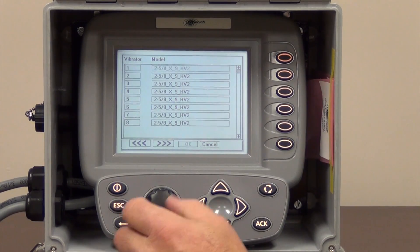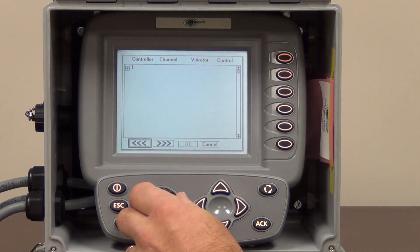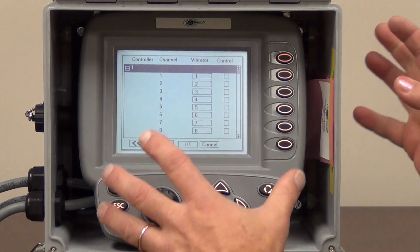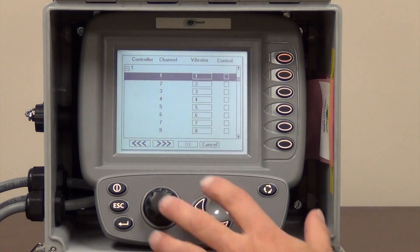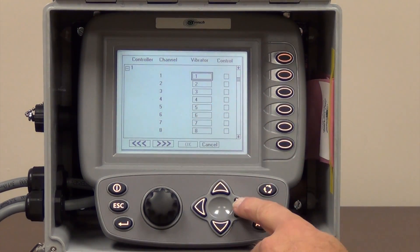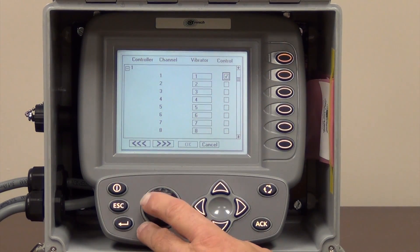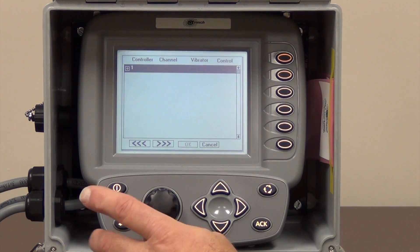We are okay on that page, we'll escape. Right click twice and highlight the arrows to the right again to go to the next page. This is the page where you make the system either an AutoVibe 2 or AutoVibe 3. If it's an AutoVibe 3 system where you're controlling the speeds of the vibrators through the monitor, you would put check marks in these boxes on the right hand side. This is an AutoVibe 2 system where you're just monitoring the speeds of the vibrators and still controlling them manually on the paver, so we want to take those check marks out. Put the plus sign back in — we are done on that page.